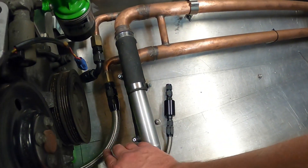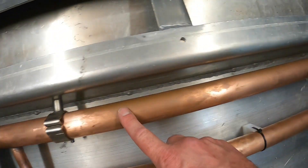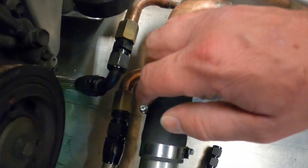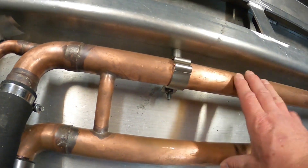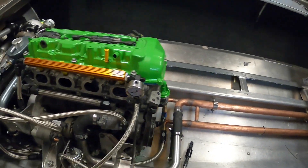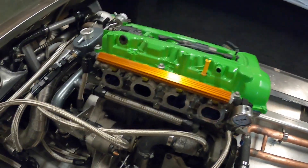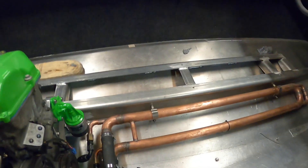The engine coolant is inside here, runs all around, and the cold water from the river goes through the smaller inner tube — that tube runs inside this larger tube and comes out the back, joins up again, and comes back through. Cold water gets pumped through and takes the heat out of the engine coolant. We're using a closed cooling system so instead of having river water run through the engine block and blocking up all the galleries with silt, we can have glycol in the system through the header tank.